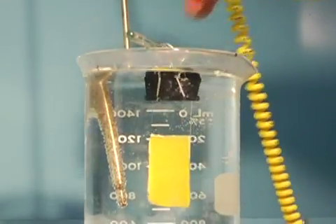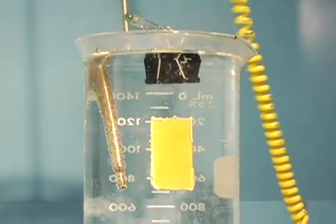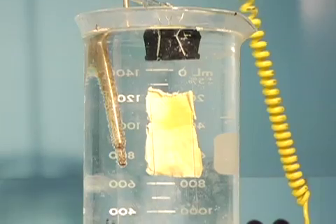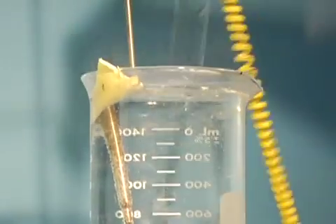When you are done working with your bonded materials and want to separate them, submerge the bonded pieces in water that is 195 to 200 degrees Fahrenheit. The components will miraculously separate in as little as 30 seconds without a trace of adhesive on them.